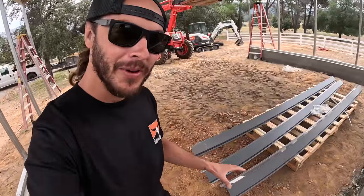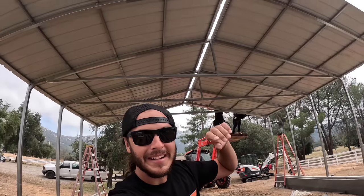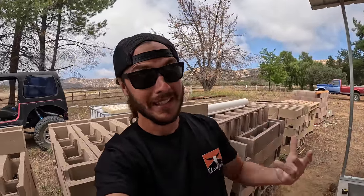Now that all the roof panels are put on, we're moving to these gable end pieces. For whatever reason, they sent these as 2 12-foot sections. The problem is that doesn't give us enough room to make that seam in the middle. I'll show you when they put that other one back up in place. Basically, we have to use 3 pieces on both of these ends. And they sent us 6 pieces, so they knew this was gonna be a thing. Instead of making these like 14 footers, 13 footers, whatever, because all this metal, remember, was made to order for this kit.